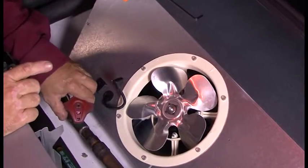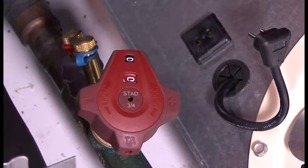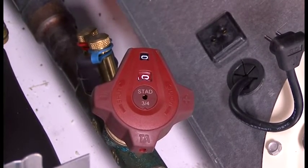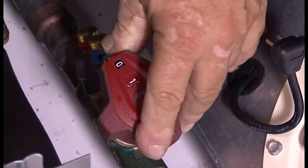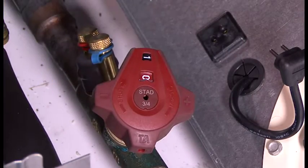As we close the valve, we can see it's already calibrated to zero. Oftentimes they are, sometimes they're not, so we must check them every time before we set them. Now we're calibrated with the handle at zero and we have no flow. Let's go ahead and set the balancing valve to 2 GPM. As we said earlier, 2 GPM means we set the handle at 1.0.